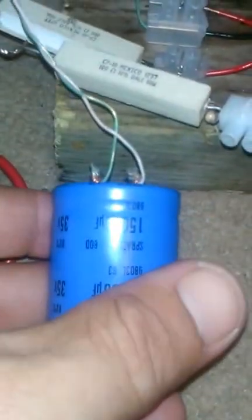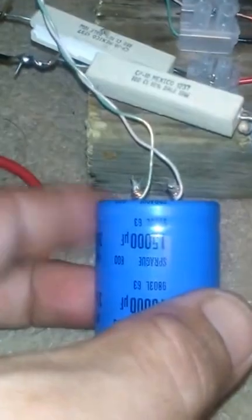The super cap — I just noticed, since I changed the resistance up — is actually warm. It's really warm. So I'm going to have to connect this to a battery and disconnect the super cap, so that I'm charging a battery instead. This super cap is not meant to handle the power this thing is putting out, so I'm going to have to change it up and make my next video.